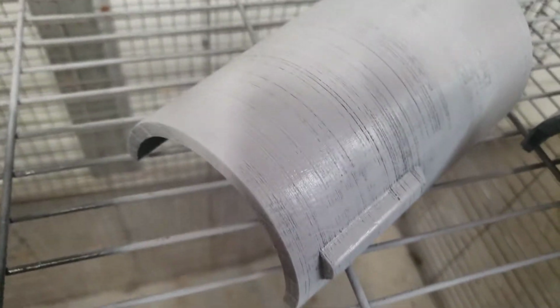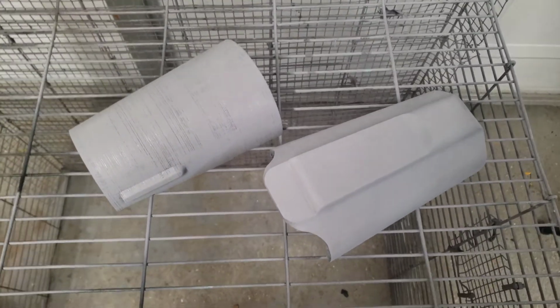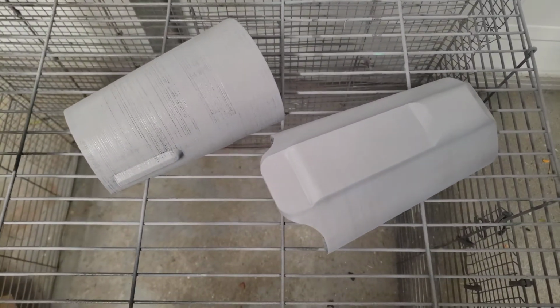Okay, so here we are, just a very light dusting of filler primer. And you can obviously see on the one that I just scraped how there are still trenches and divots and massive amounts of stuff that have to be filled in. Whereas when I go over to this side that I had used the resin, it is infinitely cleaner. Now, both of these absolutely need a whole lot more work, but I'll tell you what, the resin first sure makes sense to me.